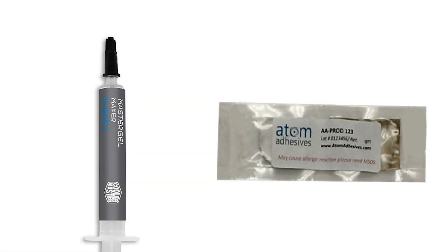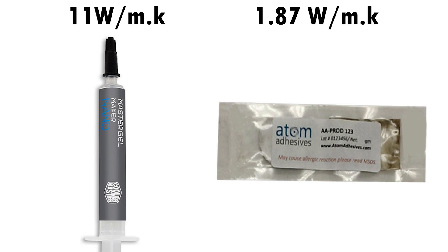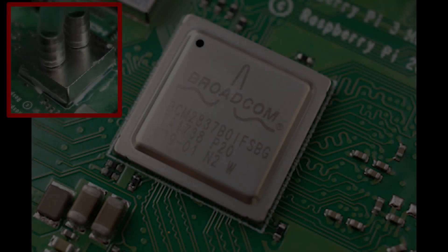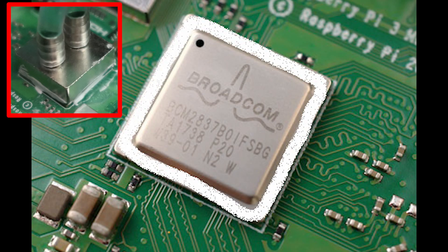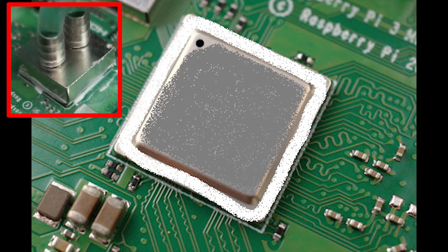When it comes to the CPU, I did quite a bit extra. I used Cooler Master MasterGel Maker Nano on top of the CPU lid — its heat transference is rated at 11 watts per meter Kelvin, which is far better than thermal glue, rated at 1.87 watts per meter Kelvin. What I did was spread a small bead of thermal glue around the outer perimeter of the CPU lid, and on the inside I put the thermal paste just on the highest elevation part of the lid.